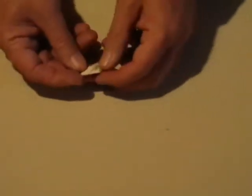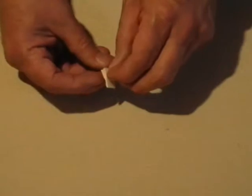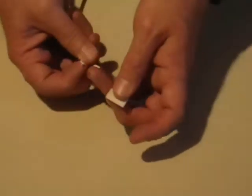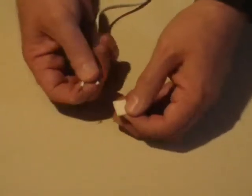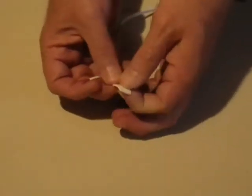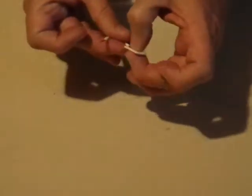What we're going to do today is use this thin mounting tape to make a battery interrupter. I've already cut things to size. Here's the mounting tape. The first step is to remove the protective layer on both sides to get at the adhesive. Next, you take the wire that I've already stripped and place it on the mounting tape on either side — it'll stick to the adhesive.